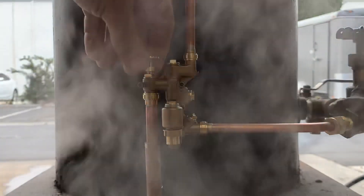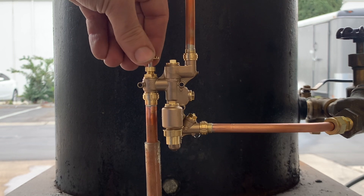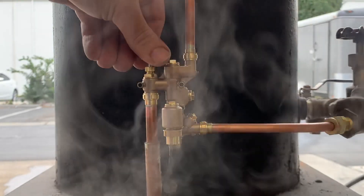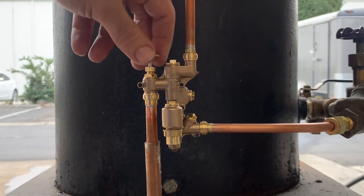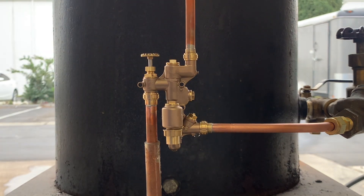As you've come to expect from Eccentric Engineer's injectors, it has a pretty wide range of adjustment. When it starts dripping, it's only maybe not even a quarter turn from closed and then I can go wide open. This is at around 140-145 psi now. It has a water filter built in here and a steam filter built in here. Anything that would be big enough to clog the injector will get caught in those two filters.